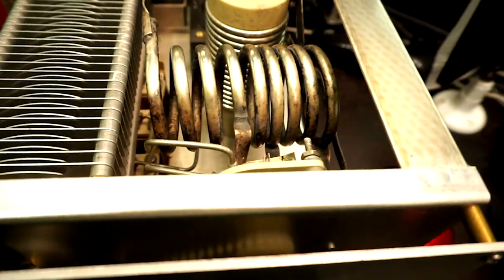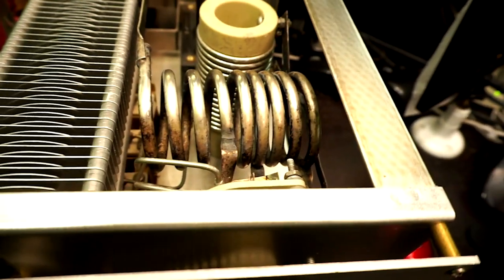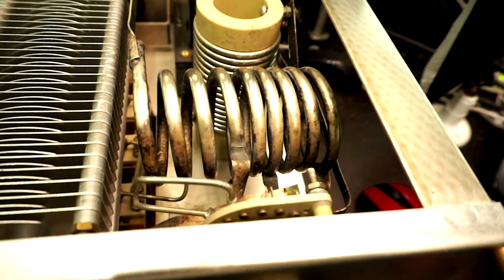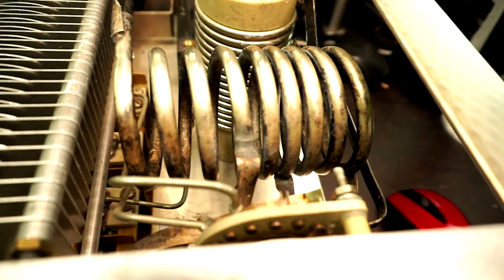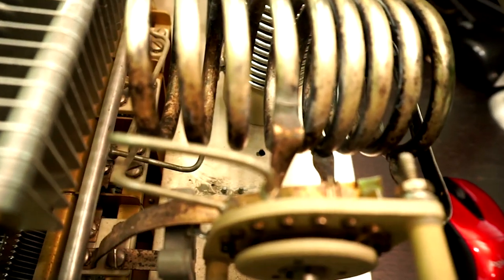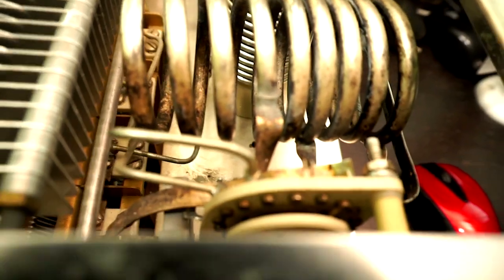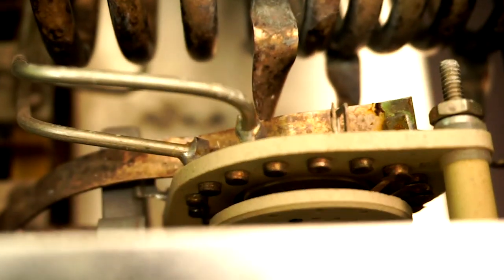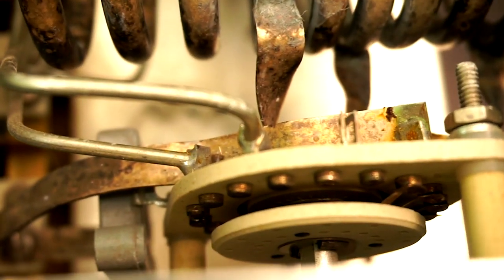The band switch is good, which can be a problem. If the band switch is broken, that would be one of those things where I would not buy it, because the repair would be very hard to do. In the next video I'll go over the parts and pieces that make up this amplifier. It's a good-looking amp. If it's been well-maintained, maybe a one-owner, and if you can get it for a thousand dollars, you'll get a good amplifier. I'm zooming in on one of the contacts — it looks a little dirty on one of the switch positions.